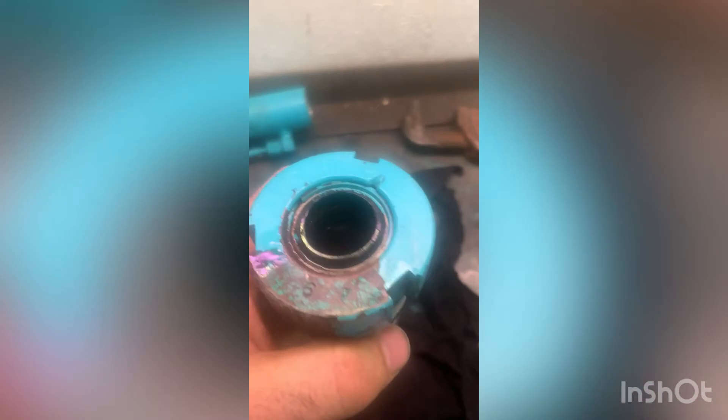This shaft has a couple of steps in it — I've never seen one like that before. First, I'm going to try to take this seal out of the end. If you look really closely right here, there's a snap ring holding that first one in, and then there's — I'm not sure if you call it a gland or what — that's down in there that also helps, probably does the majority of the sealing, and this is more like a dust cover out here. There's rust going on in here, so I got a pretty fine bristled wire brush and I'm going to try to clean that out of there.